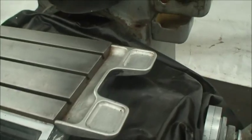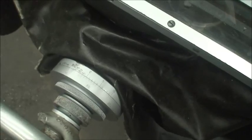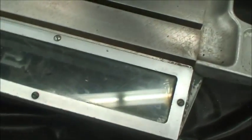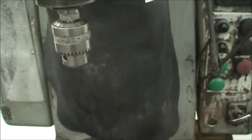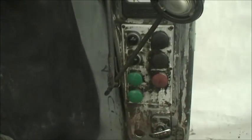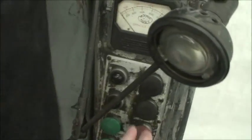I will say, first of all, that the ways are in very good condition. I don't know how well you can see them here, but they are in good shape. The hand wheel movement is very precise — you can tell, you can feel, it still has the accuracy. It's equipped with a drill chuck. Work lights do not work, and we're thinking that this tachometer really doesn't work either.